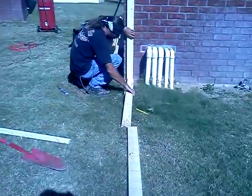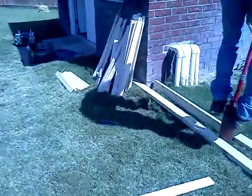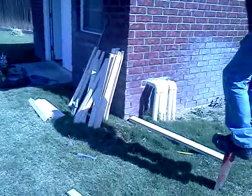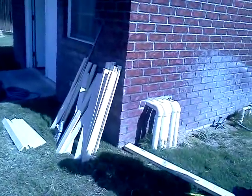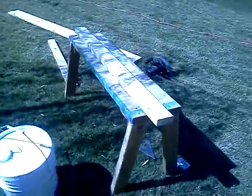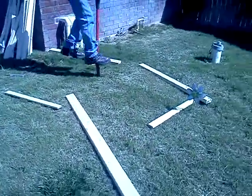Of course, we are editing this to make it go a lot quicker than normal. We've decided to go flush with this building so that our fence comes out perfectly — a symmetrical line. Since we've decided to put our posts up against the building, we're going to paint our post first before we install it onto the building, to be safer than sorry. In the meantime, Brad's going to get the remaining holes dug and get it ready.